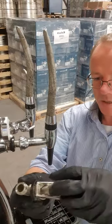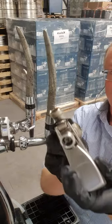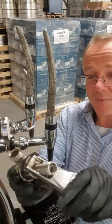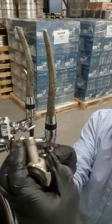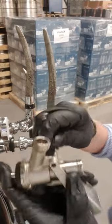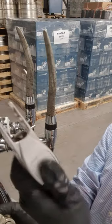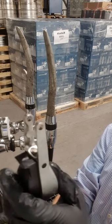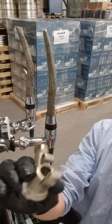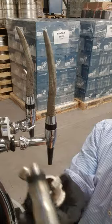The non-return valve on the beer outlet side is a bit different — it's just a floating piece of plastic that comes down against a surface in the bottom to stop flow going through the wrong way. To disconnect, there's either a screw or a clip — just take it off. Don't put the handle in caustic cleaner; there are brass pieces in there that would react with it. You've got two O-rings inside there and one rubber seal on the bottom — put them all into your solution to clean.